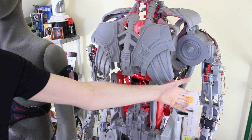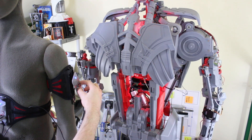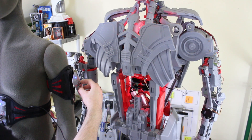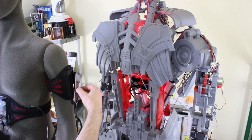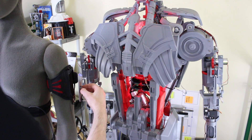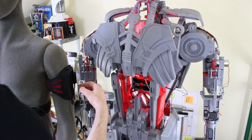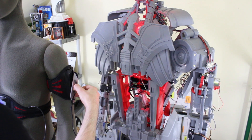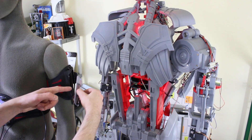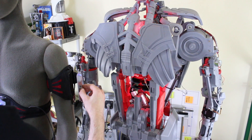You should now find that keeping the arm straight works much better. If I move the sensor in one axis, it tries its best to keep the lower arm always pointing forwards, even though that means it's moving the z-axis and y-axis. And if I rotate the sensor, we just get rotation — not too much upper arm rotation, just shoulder spin — until I move it the other way and the upper arm rotates as well to try to keep the arm parallel. I'm pretty happy with that; it works much better than last time.